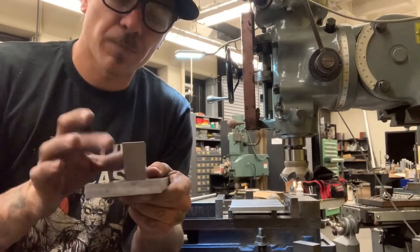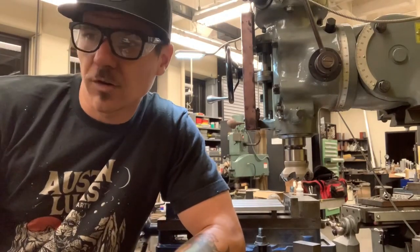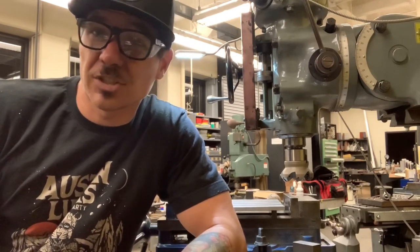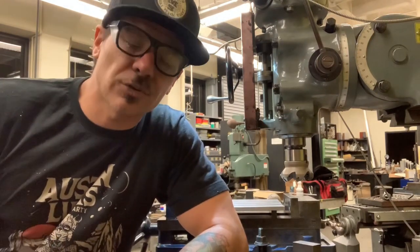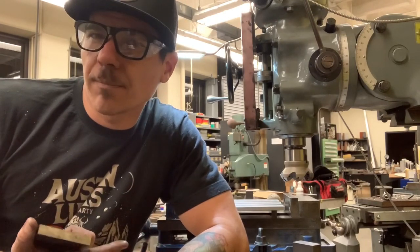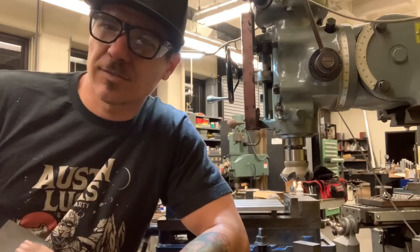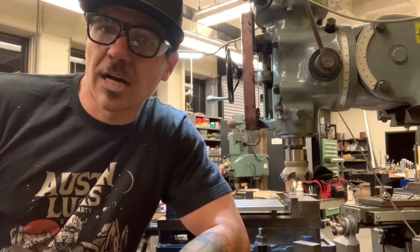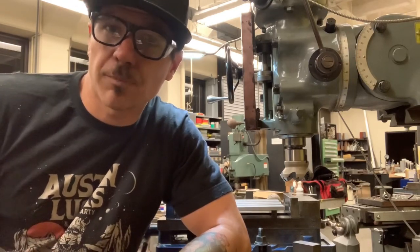The trick is cutting that angle. I talked to Andy at Coal Ironworks and he told me they usually use a four degree angle. I've been a tool and die maker and R&D machinist for a long time, and you don't need much of an angle to create a locking mechanism like this — so I went with two degrees. That allows me to cut less deep every time I face cut. I'm going to be cutting about 12 at a time on a smaller Bridgeport, so I want to take big passes and not waste time on multiple small cuts.